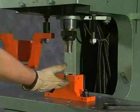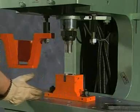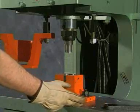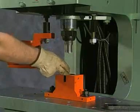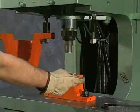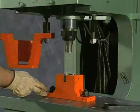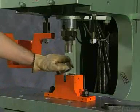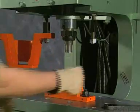For punching, the die block is located on the platen table, which is an integral part of the machine and is the foundation for punching, bending, and other optional tooling applications. The die block has a machined bore for the die, a set screw to secure the die in the die block, and three set screws to set the die block location on the platen table. Place the die in the die block bore with the proper side up and lock it in place with the set screw.